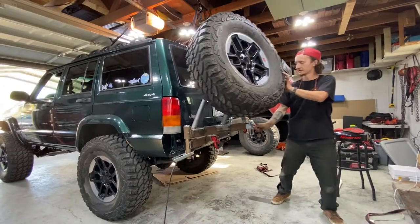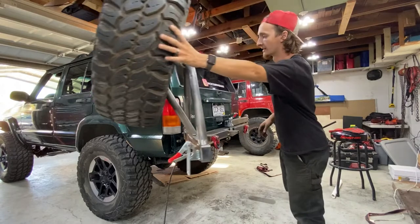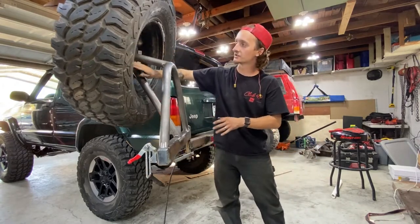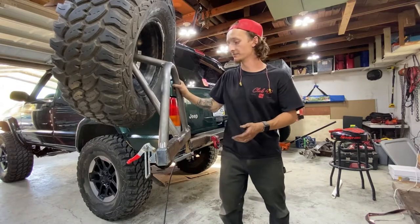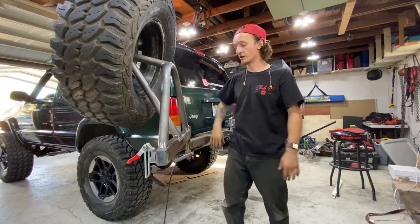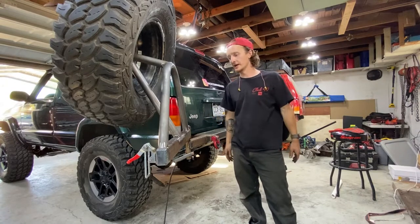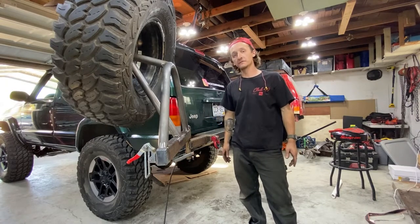Tacked in right there, and everything's looking really good. I'm really happy with this fitment up here. The support actually attaches to the plate and this top piece of DOM, so it's making both those pieces stronger. And it comes down right here really nicely. It comes down to a 30 degree angle is what I found out, and so far so good.